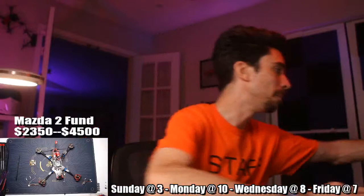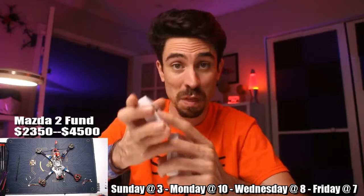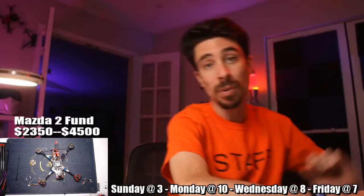What I'm thinking of doing, I bought the new Sharkbite VTX, the single stack 20x20, which also won't fit in any frames that I fly. But I think that this will fit in a rip squeak. So I am going to be building a rip squeak designed to carry the Insta360 Go 2. And I think I can maybe fit this VTX in there so we can have a Sharkbite micro. At 200 milliwatts, realistically, a micro is the only thing that's going to work.